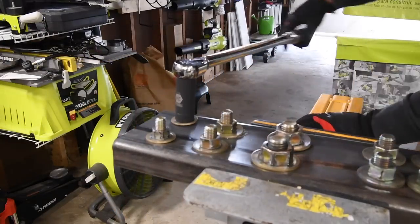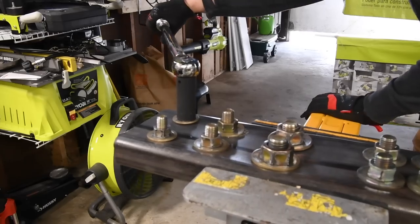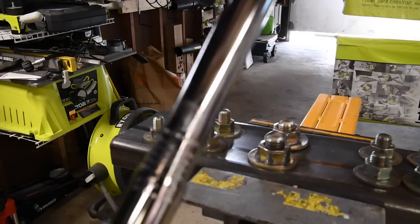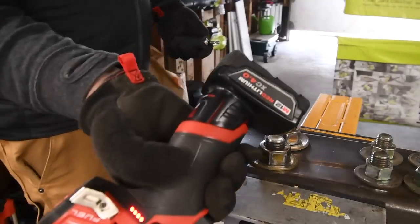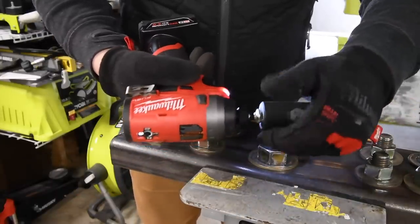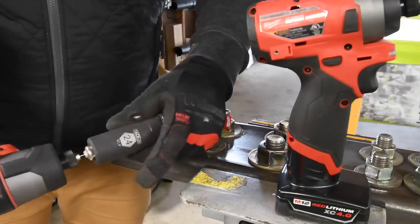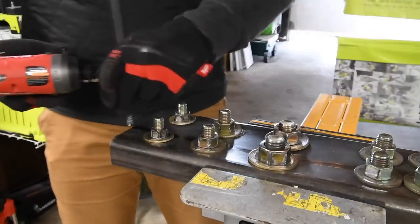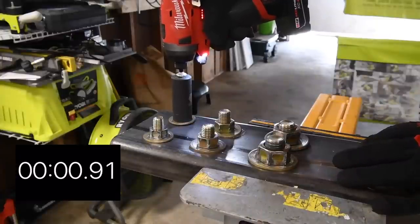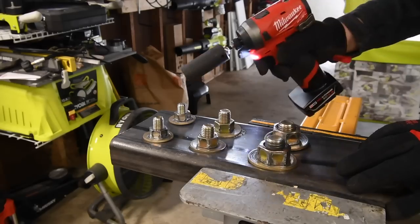Considering how long that took to bust 110 foot-pounds, we'll only do one. Let's tighten this back to 110 foot-pounds. Time — got that. Battery is full, on speed three. The Milwaukee has a quick-insert collet; the Skil does not — you have to adjust the Skil to put the bit in, but the Milwaukee is quick insert. Let's see how long it takes. Ready, go. Time — significant difference right there. Based on how much the Skil struggled, we're going to end this test and move to the log.